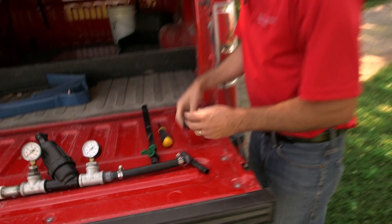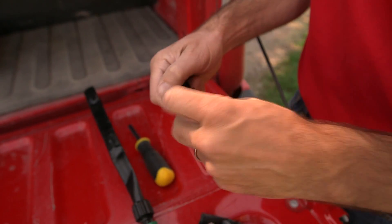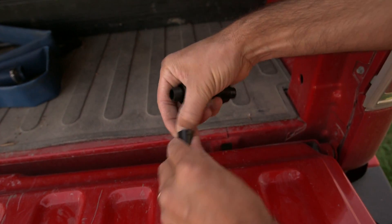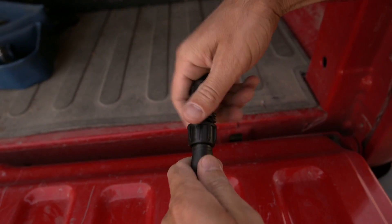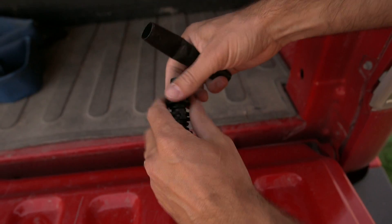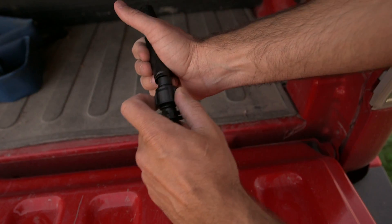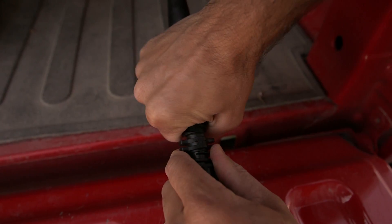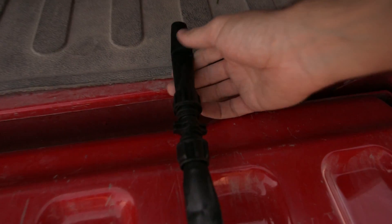If it's July or August and your irrigation system suddenly has a problem — say a hole in your drip tube — we can easily fix that. They make nice little adapters. We cut the drip tape where the hole is, insert the adapter on one end and close it down, then do the patch on the other side. Insert the other side of the drip tube, patch it up, and we've got our drip tube placed back in the field.